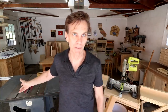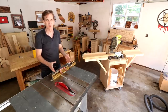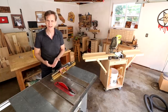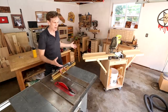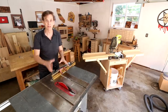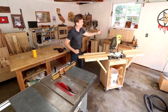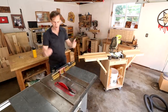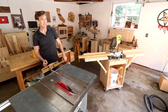I don't really have specific rules as to which tool makes a better crosscut — it usually comes down to the size of the board I'm cutting and how many of the exact same size I need. Mostly it comes down to what makes the most sense for the particular board. The first thing to consider is how much depth you can get out of your saw: my miter saw will only cut about eight or nine inches, whereas with my miter gauge on my table saw I can extend it back about 18 inches at maximum, though it gets a little tricky to keep it stable.